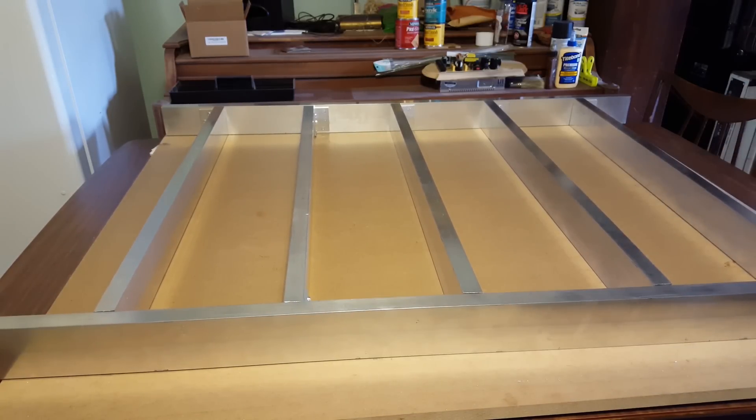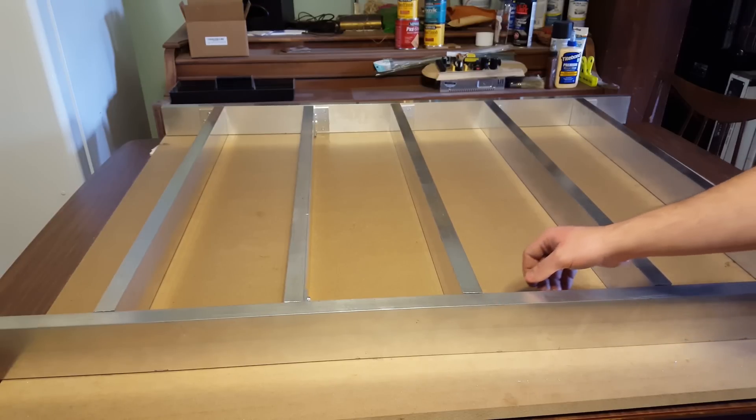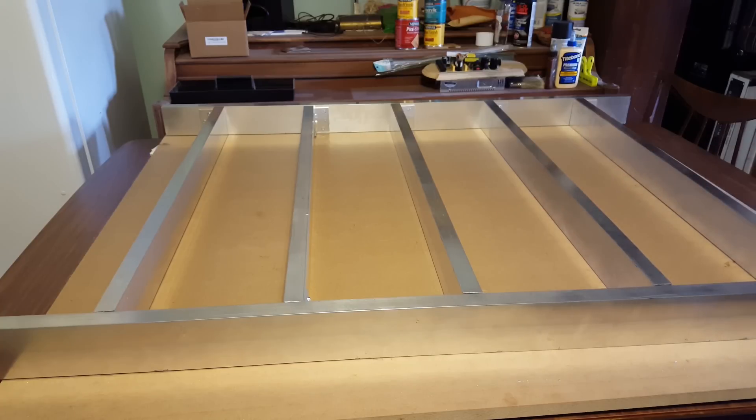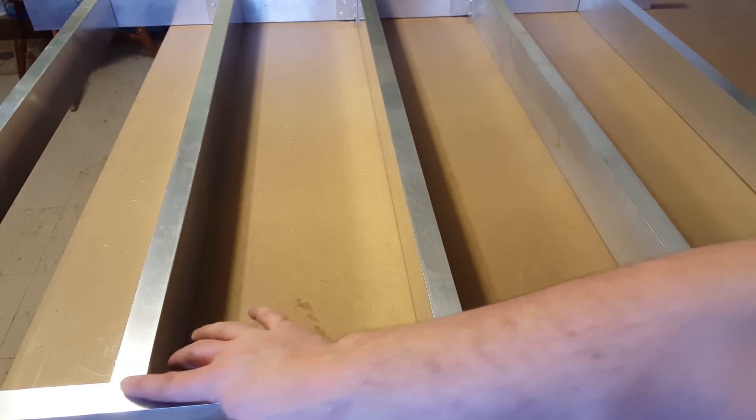What I think I'm going to do is unbutton these from the bolts and drill them out a little bit bigger so I can adjust slightly. I could do that or use a little bit of shim stock on top between the MDF and the surface of the frame. Because I failed at getting a very flat surface — I still think doing the MDF on something and leveling it out would work, I just sucked at actually getting it to work — I've gotten two of them done and they seem a lot better.